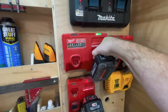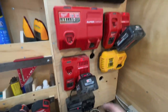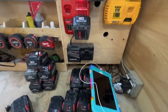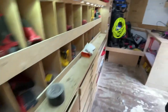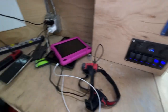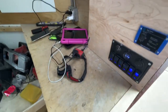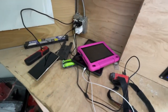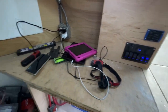The rapid chargers — first one is done, let's put a 12 amp-hour on there. Everything else is still charging, the TV's still going, everything's working fine. We're at 11.5 to 11.6 volts under load — that's fine. Deep cycle needs to stay above 10.5 under load. I've never actually seen it lower than about 11.1.